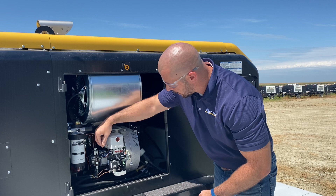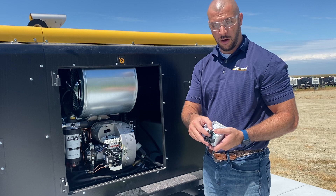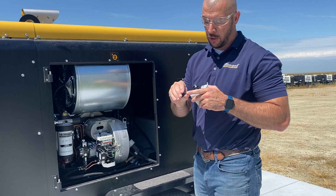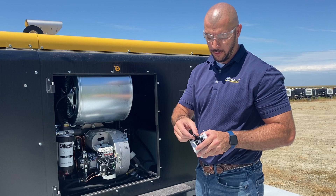If we want to get to our fuel rail, it's pretty simple. We have to loosen up the set screw on the side of the ignition transformer, and then it pulls forward and comes off. On this, you actually have your photo eye. This is what detects the flame, and then it shuts off the burner if the flame goes away for any reason. These can actually be pulled off of the ignition transformer. You can clean the lens with a soft clean rag or towel, and then it can also be replaced.